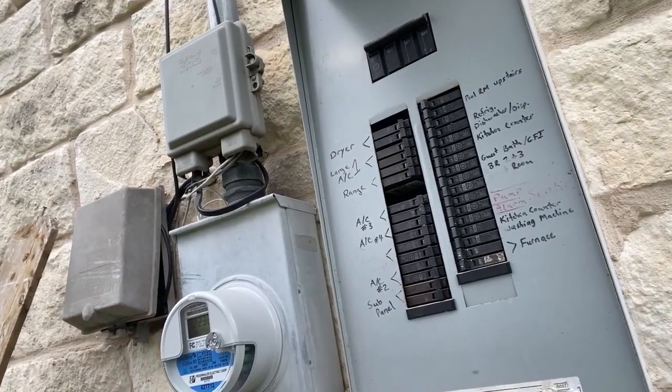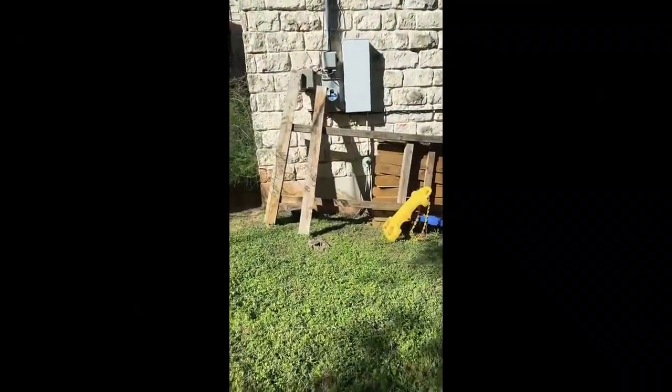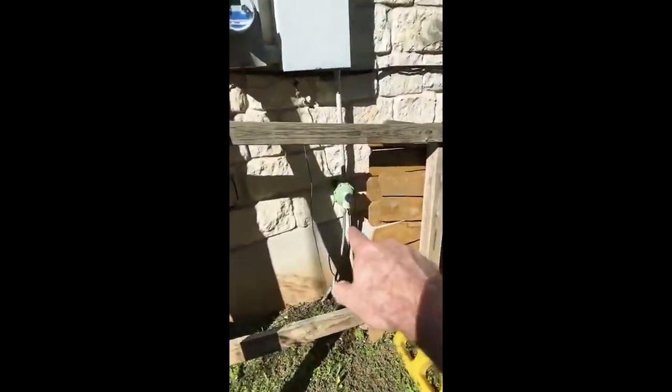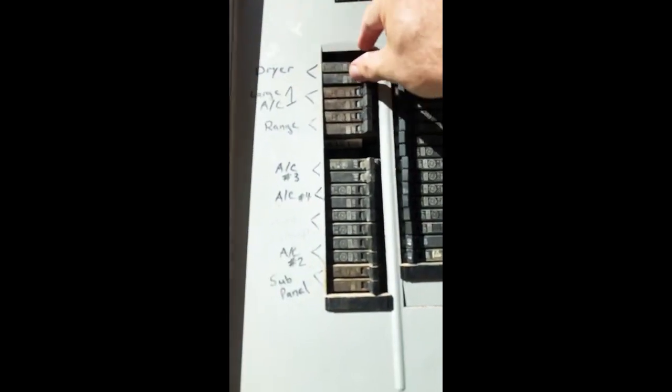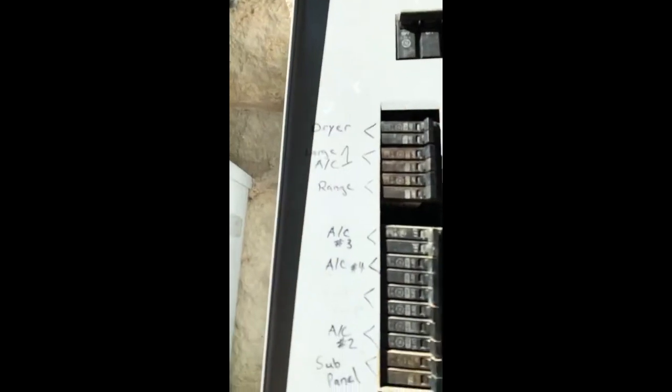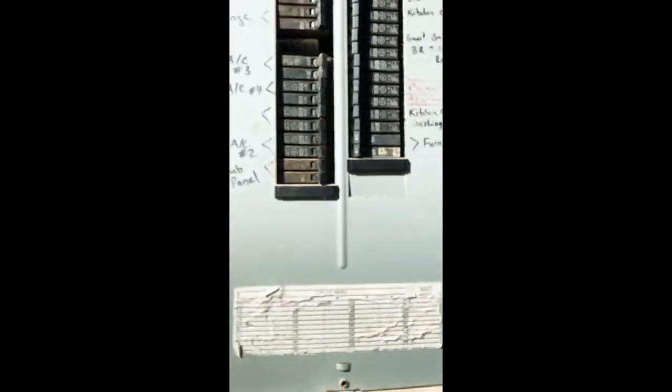So that is what I'm going to be working on this morning. I'm going to be installing a pad right here, hooking in to the propane right here, and then installing onto the electrical box a 50 amp circuit, interlocked with this so that it can't be turned on at the same time — to protect for backflow of electricity — and moving the other switches down.